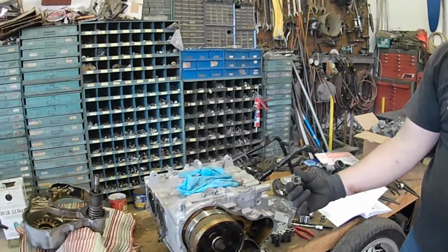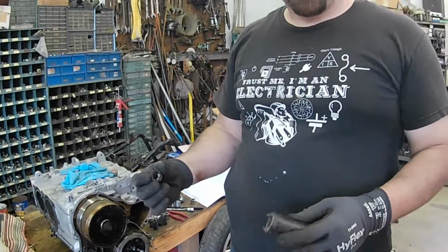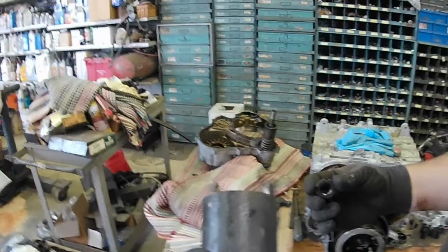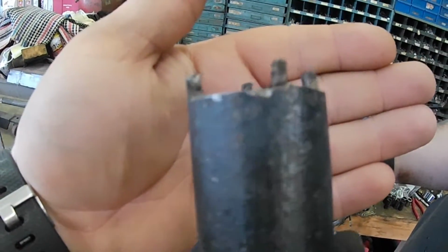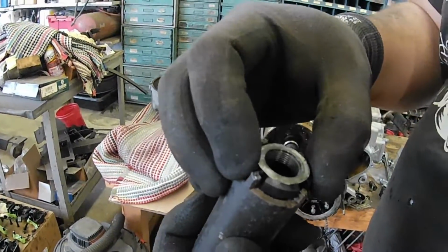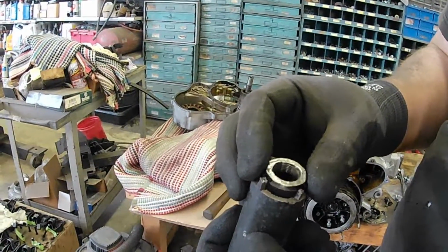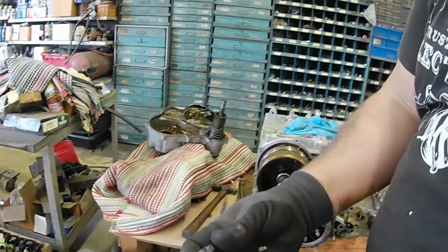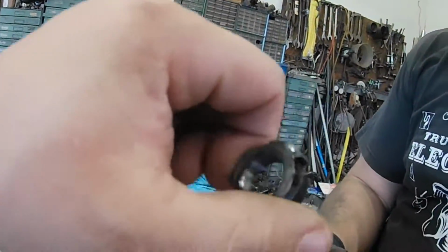And in the book it says to use this special tool to get your clutch basket off there. So this is something that was homemade, and I'll get it in the background here. Once again, not pretty. And actually, it's about ready to break a couple tabs off. We'll have to remake it, but there it is. It fits in there. That was one he made when he was doing his chopper, but it was good enough. Actually, I think this one's a little smaller than what the chopper was. I remember the one on my chopper fitting better than this, but it got it off without breaking or bending or damaging any part of the clutch basket.